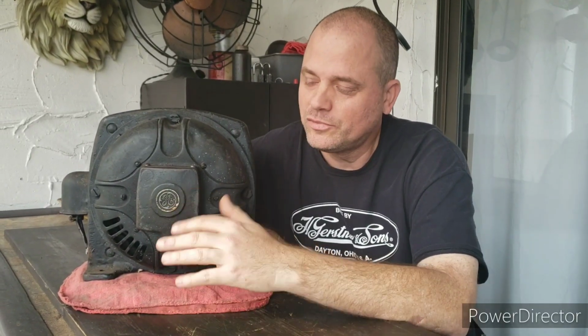Hello everyone. In this video we're going to be restoring this beautiful motor which was made by General Electric. This motor is a type SCR, and that stands for Squirrel Cage Repulsion. What's unique about this motor compared to other motors that I featured on the channel is that this is a true repulsion-induction motor. It does not have any type of a shorting necklace like the Century, for example, which is a repulsion start induction run.